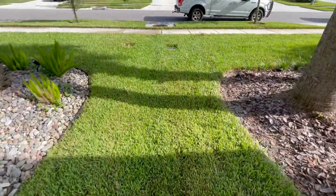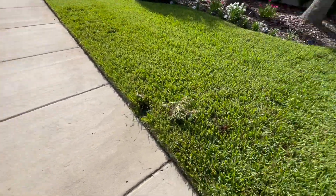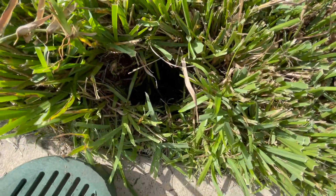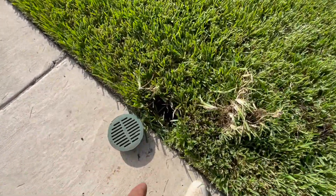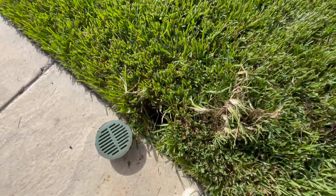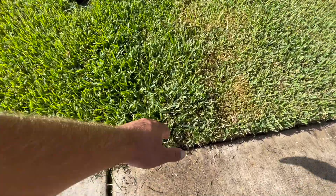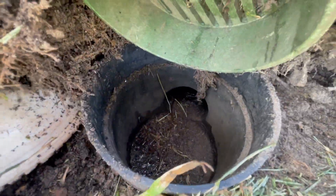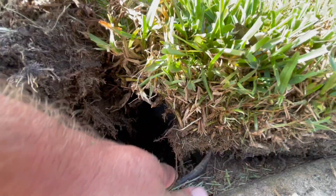When you come down here at the end, we've got a good slope here too, so these emission points should be pouring out water if there's that much there. Bone dry — there's no water in this catch basin. We don't like using catch basins as emitters. There should be a lot of water up to the height here and there's not. The neighbor's is actually pretty much non-existent — it is under the sod here, you can pull it up like carpet, and it's bone dry as well. The water level should be at the top of these catch basins if it was done with proper slope.